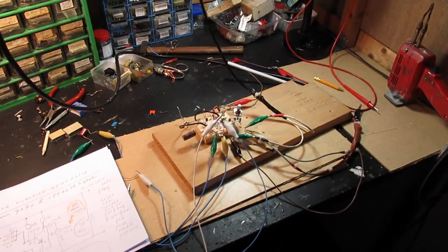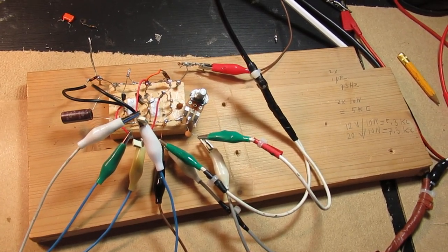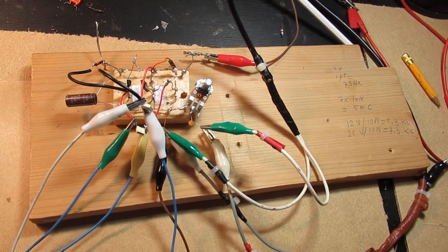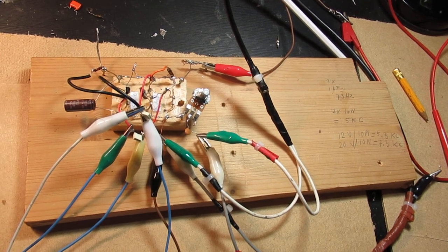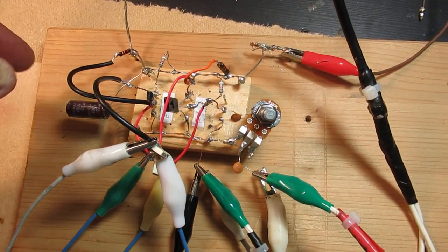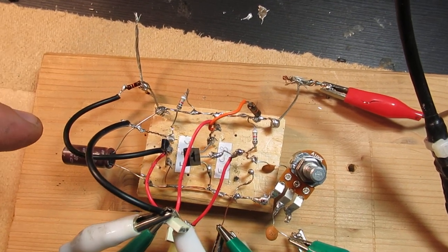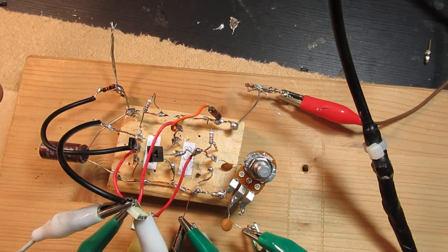A few days ago, I published a circuit of a multivibrator, and I told in the description of that video that you can make also other frequencies, and especially you can use it as a kind of function generator. And I thought that you could use here, instead of the 10k resistors that are going to the base, a potentiometer. I tested it all over again today, and it did not work very properly.